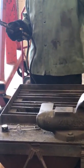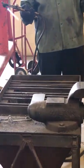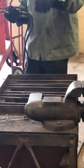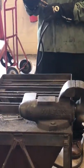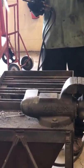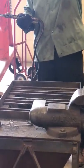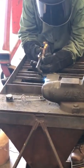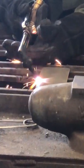I'm going to cut from right to left, so I'm going to tilt the torch a little bit so we're leading it — meaning we're pushing that heat out in front. This helps us cut, and becomes even more important the thicker the steel, because it's going to take more heat. Get nice and comfortable. As soon as it starts to melt and we start seeing the orange bubbling, then we can hit the lever to push the slag out of the way. If we hit the lever too soon, it's going to cool our cut.